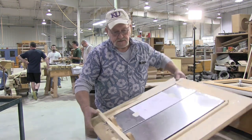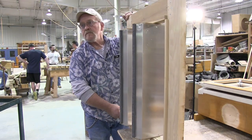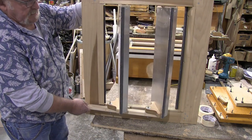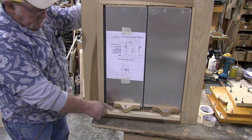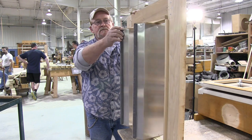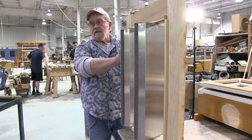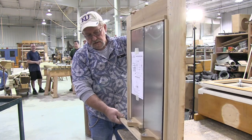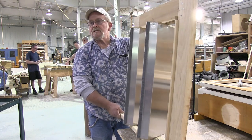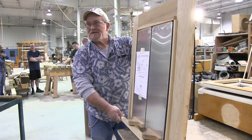These are shade frames that open and close to control the volume of the pipe organ. The pipes are back behind here, or back behind this side. This is the trace arm and the dogs. These are made with aluminum and solid blocks of wood with soundboard on the inside, and those work on as many as 15 of them together to work that many shades. They used to use wood, but aluminum is easier to work with, and it's lighter.